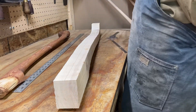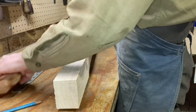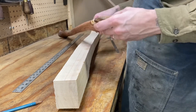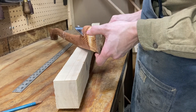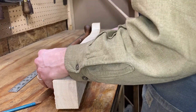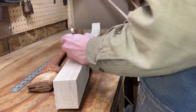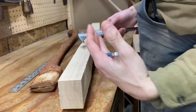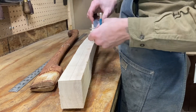I like that for center, and then it flares out up here. Typically I like to do a lot of that actual flaring just by hand with the draw knife. So I'm going to take that measurement and actually flare that section so that happens right there. That's where the shoulder is — sometimes it comes in a little bit more once you're done working on it, but you always fuss with it then.